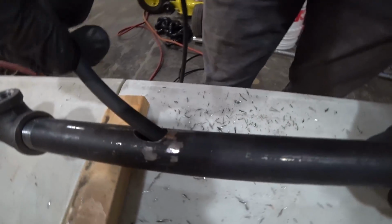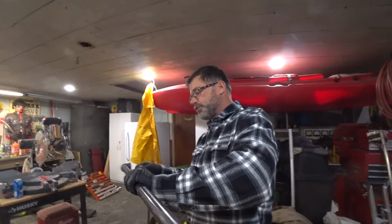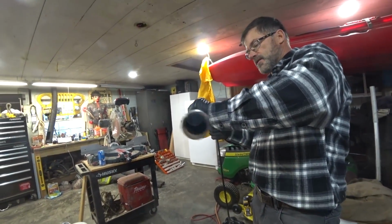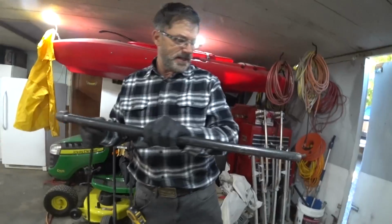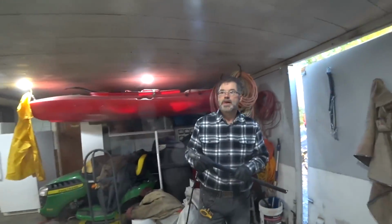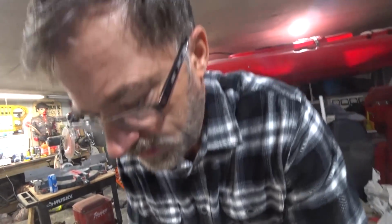So this wire is just going to slip very easily down this pipe. And to prove that, right on cue, look at it. Huh. So how'd you enlarge it? Well, first we put a hole in there, like you saw in the drill press, right? Then we took a hand drill, stuffed it in there, and just tilted it until it chewed out that steel.